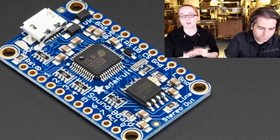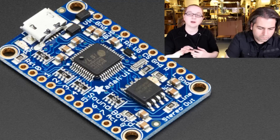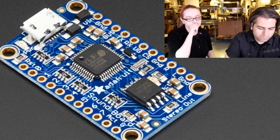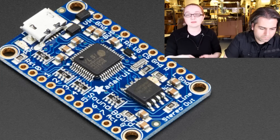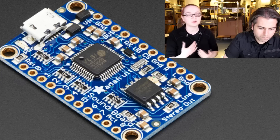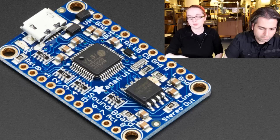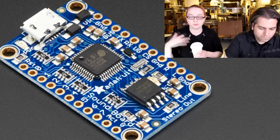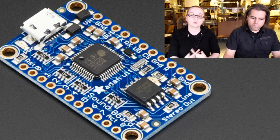It's very popular. This one has eight triggers compared to the other ones, but it's a lot shorter — instead of having the extra three triggers and audio amplifier and headphone amp, I just made it more compact. The software is the same. And I finally got around to documenting the UART interface, so you can also control it using an Arduino or similar microcontroller with 3-volt or 5-volt logic. You can send UART commands to play, pause, and list files. So if you don't want to use the pin triggers and you're willing to use a microcontroller, you can control it over UART for more precise control. We don't have the pausing capability with pin triggers — you press it and it plays, you release and it stops. We used it for the sound cup because it's great for just having something turn on and play in a loop or play different files randomly. But now we also have the UART control documented, and I'll do a demo showing how you might want to use it with your Arduino for really high quality audio.